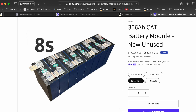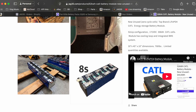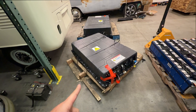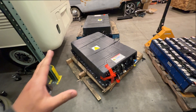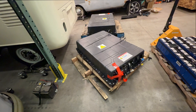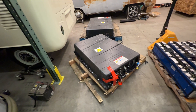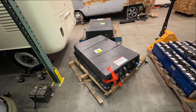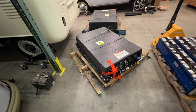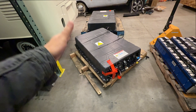The first video already had those questions. There are a bunch of ways that you could do this, but definitely the easiest one would be to modify this into a 48-volt battery. The reason is because everything out there is 48 volts — that's the standard. You can find a bunch of inverters for it. As it is right now, this module is 171 volts. You can find an inverter for that, but they're usually industrial, dealing with three-phase, and it's not for the average person buying these. These are so cheap right now that regular Joes are buying them — so what can you do with them?